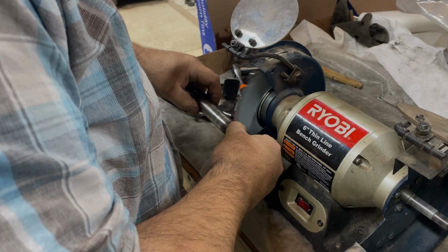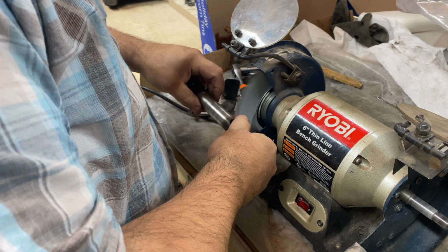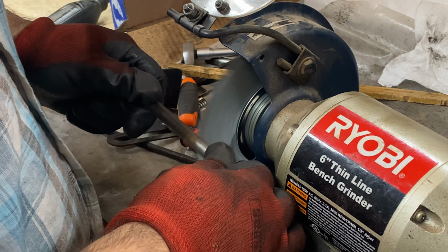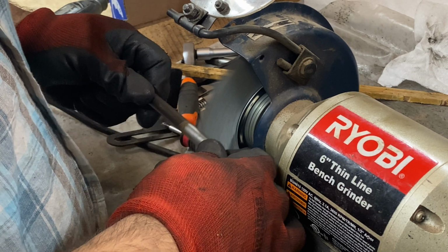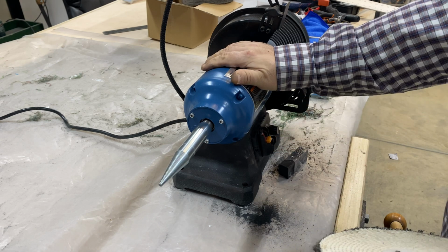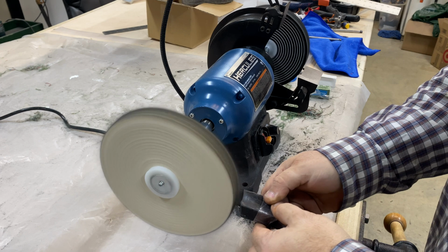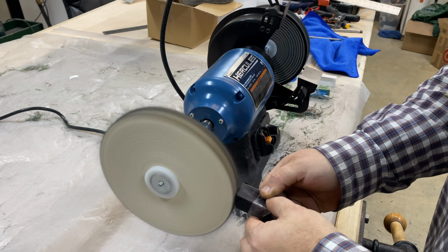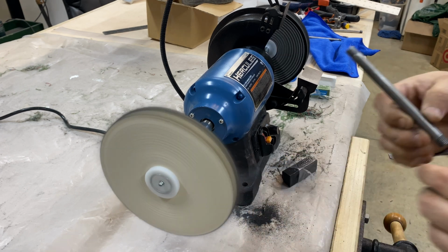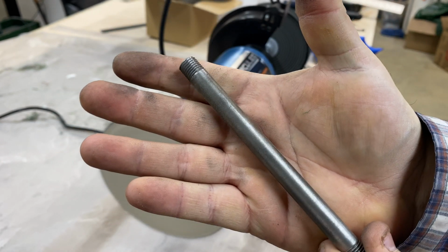Started out using a wire wheel on my grinder to get all the hard to get rust off of these pieces, including the handles and the engine mount shafts. Then I went over to some buffing wheels. These buffing wheels are by PURUI and they are excellent. I am now priming the coarse wheel. This is what it looks like before.